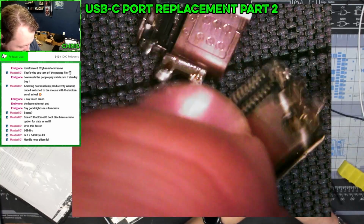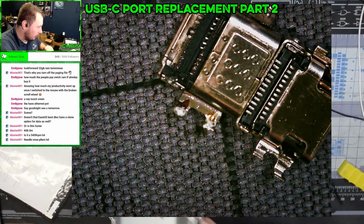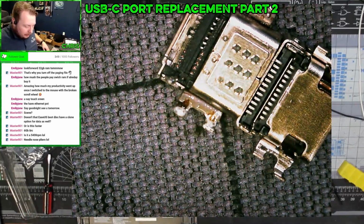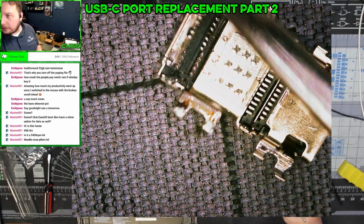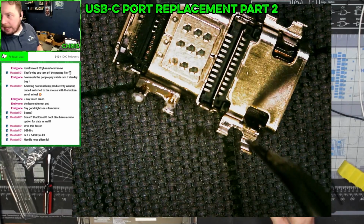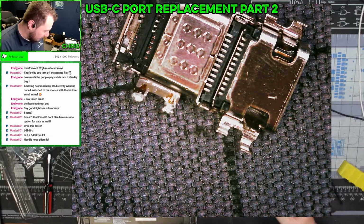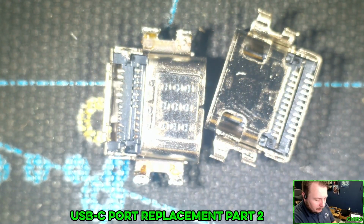There are legs down here, which are supports. I just have to see if that's gonna work. Because if I can't get the proper replacement for this, if I can't make this work, this person's SOL for getting this laptop fixed. I need to verify that these guys here aren't gonna clip anything, and then these legs I have to actually straighten out to make them more vertical without damaging anything. I need to see which of these feet actually fit, because I believe the feet that actually fit are the rear ones.